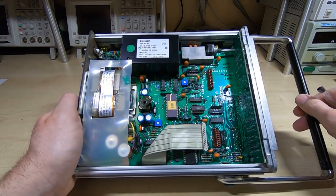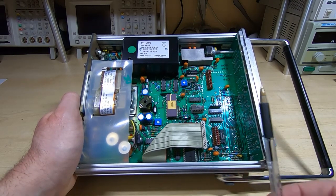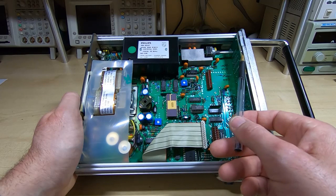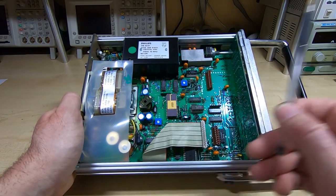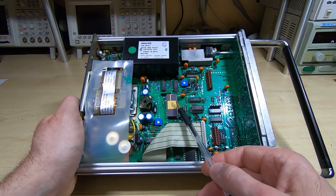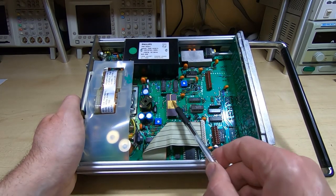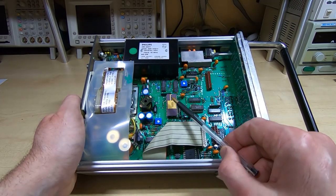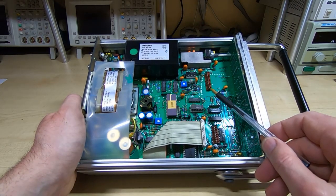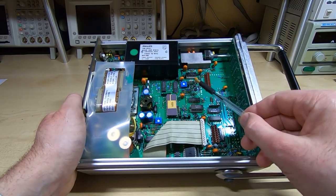The core of the system is this chip - part number OQ0040 - a custom LSI chip made specifically for this equipment. Most counter timers like this use a basic architecture of two timers: one counting pulses from the timebase and the other counting pulses from the input socket. It effectively compares those two counts - one is used as a gate to create the gating time, and the other accumulates incoming counts. Because they need to be tightly synchronized, Philips rolled their own dual counter chip.